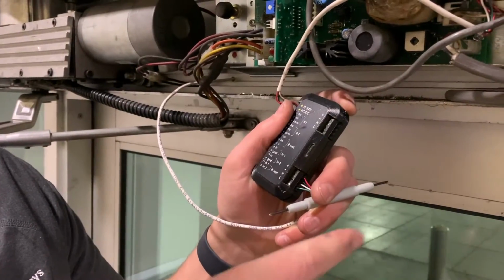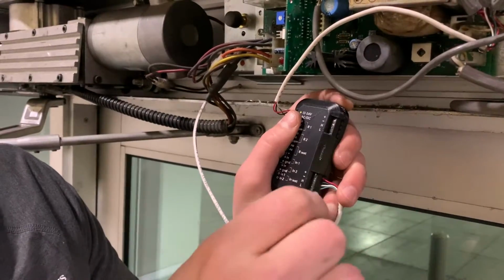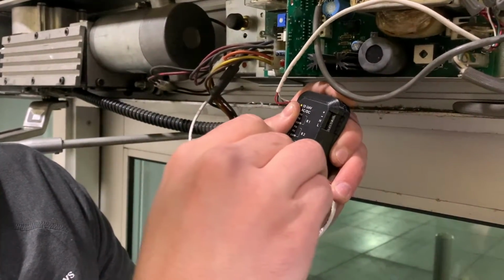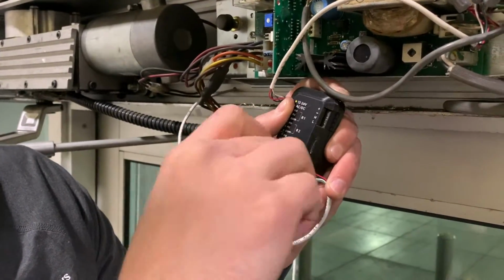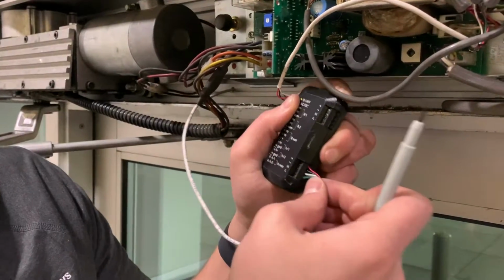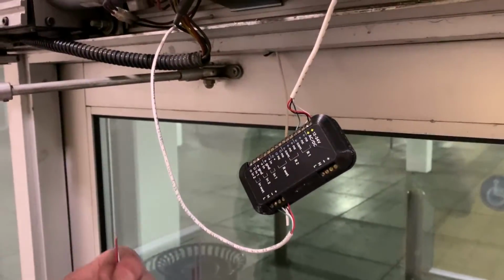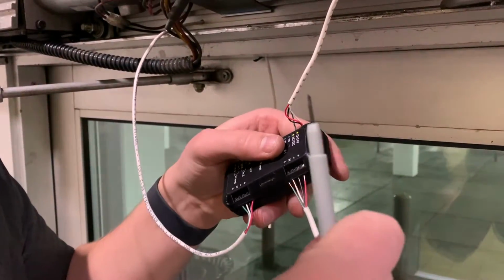I'm gonna hook up the Ingress sensor right now on these ports, and I'm just gonna use red, black, white, green in that order. So we'll make sure to go in that order on the side where we plug the sensor in. All right, make sure those are nice and snug. And then while I'm here, I'm just gonna go ahead and plug in the wires for the egress side.